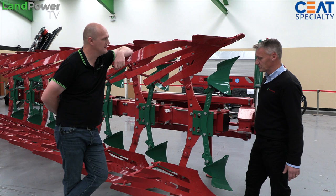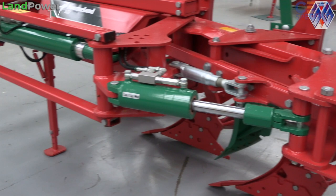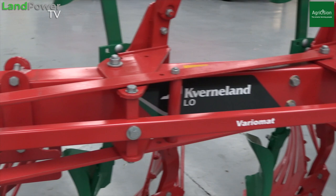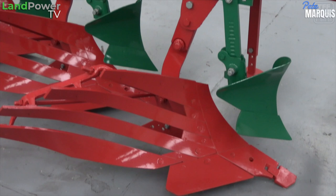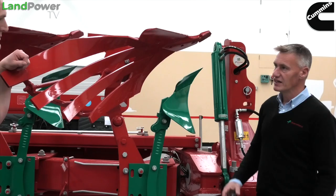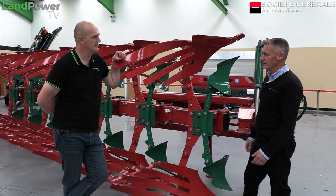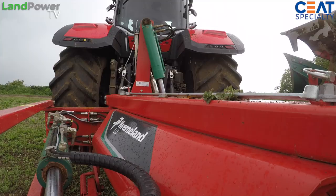Moving further back, we also have what's called a frame strengthening kit on the plow. It's there to take some of the bend or bow out of the beam itself, especially when you get into a 100 centimetre clearance plow and are plowing deeper. Body-wise, we can now go to what's called our number 38 body, which is a much deeper body. This plow is on number 30, our slatted body, but the number 38 is deeper, allowing plowing down to close to 16 inches - that's a lot of soil. In heavy soil at that depth you can get a little bow in the beam, so the frame strengthening kit stiffens it up for precise furrows throughout. It's standard on the LO Max.